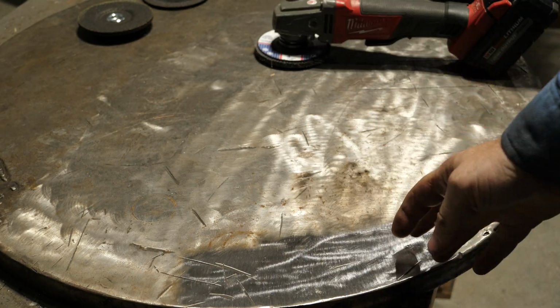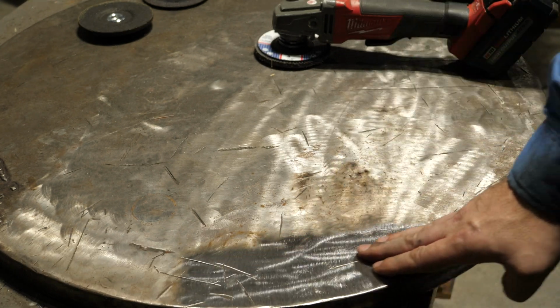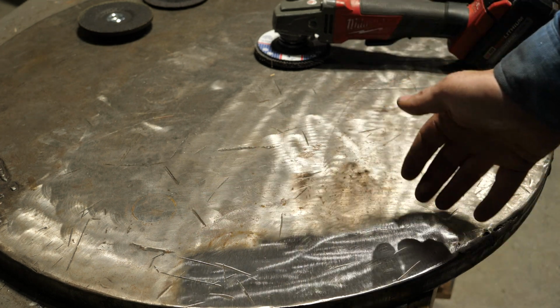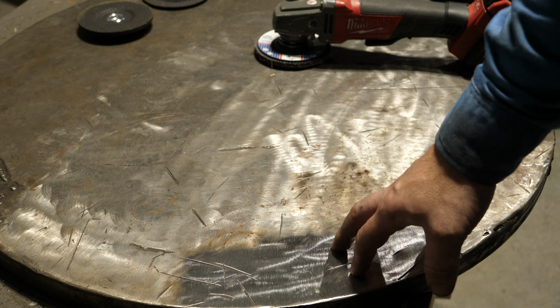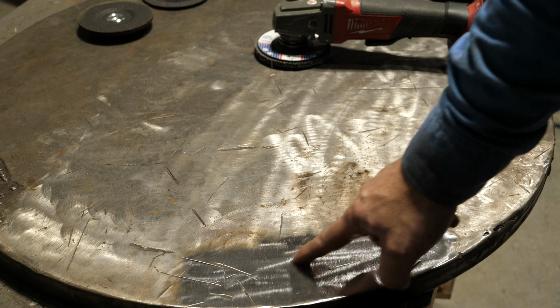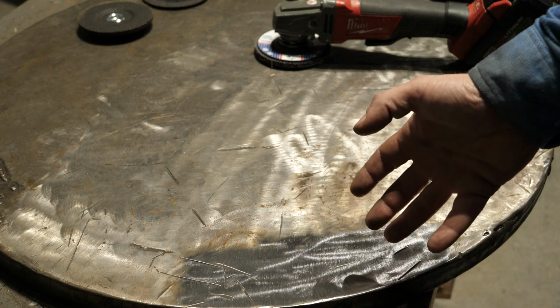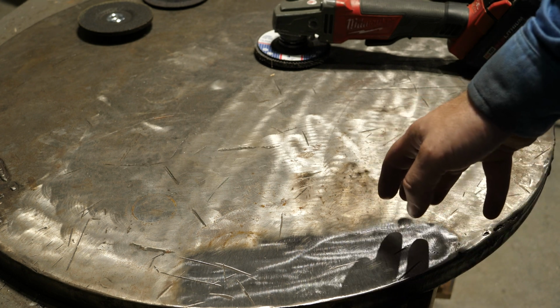You can see the 40 grit gives a pretty nice surface finish. I don't feel any peach fuzz on this. It cleaned up the rust to bright shiny, no issue there. So it works really good for that. Now, it's a little bit slow, and it left a finish that's going to take a lot more work to polish. It's not the worst, but it's not the best.